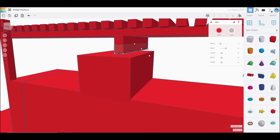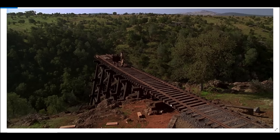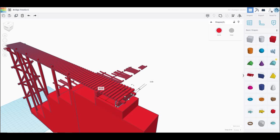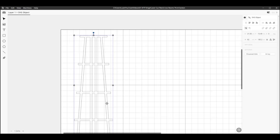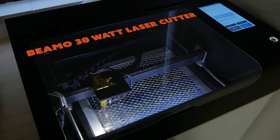The main feature of the model is the bridge. I used Tinkercad to draw and create the 3D version of the bridge, using a couple of photos from the movie to help recreate it. My initial plan was to build it using bits of strip wood, which is definitely achievable. However I didn't have enough to finish the project, so instead I pivoted to using acrylic that could be laser cut. I was then able to separate all the parts to create SVG files that could be loaded into the laser cutting program and cut.